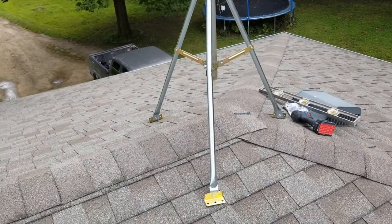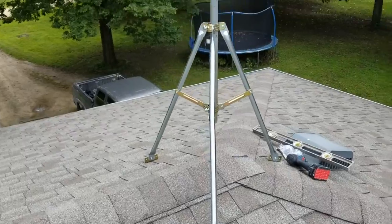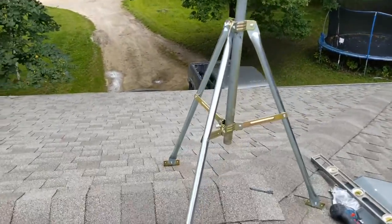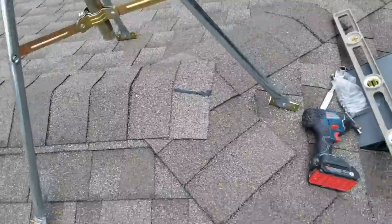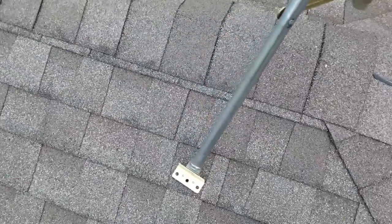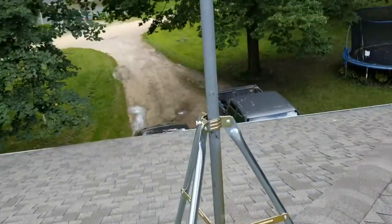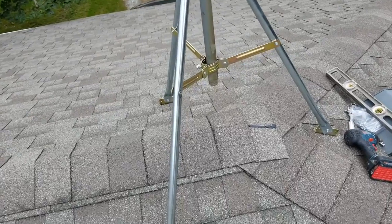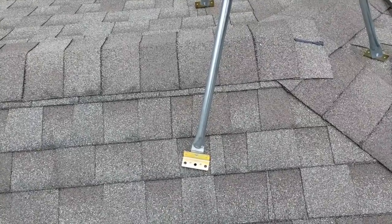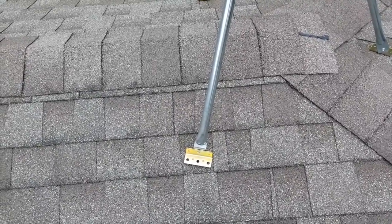I started leveling this off, and I thought, well, maybe this shouldn't be too bad, but I realized that I'm trying to level off 3 legs. So I put the pipe back in here, and I hooked the level up to it, and then I found a happy spot for it. I drilled into here, so this is one of the trusses I pointed out here that goes all the way down, and then I drilled a hole in here and here so I could find my other 2 spots. So that is where we are at here. At this point, I'm going to go inside again, and I am going to put in those stringers, and I'm already tired. What you do for your hobby, right? And then come back up here and we'll bolt it the rest of the way down.